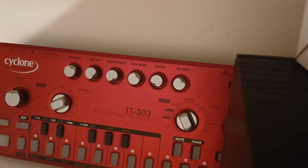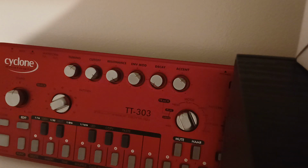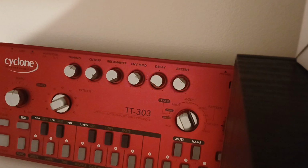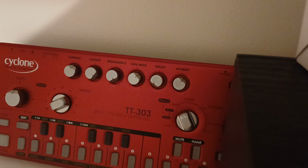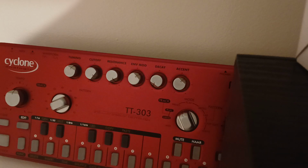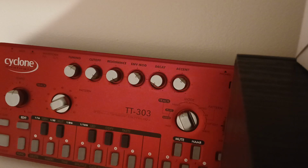I'm deciding if I want to keep that gain knob on there because it has minimal range, or if I want to bypass the gain knob so I can make these a little bit easier and give you guys more battery room on the inside, because the battery room is very limited and that kind of causes some issues. So I'm leaning towards deleting the gain knob for 2 reasons. 1, for room, and 2, because it gives you even more gain.